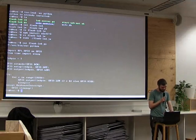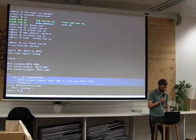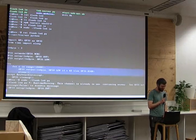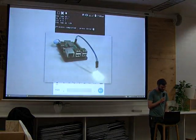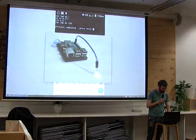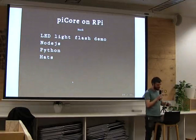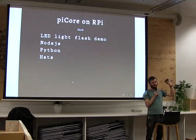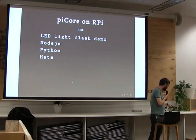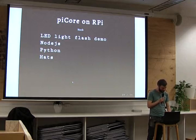I've written the exact same script just to show how easy it is using Python: import GPIO, sleep for one second, use pin three, and then go into a loop setting the pin high and low. So we'll go flash LED — and there it is. There's also some cheap hardware from China for about five dollars with a bunch of buttons and an LCD screen, and it's super easy to drive from JavaScript or Python.